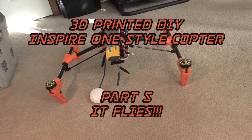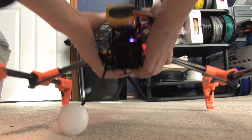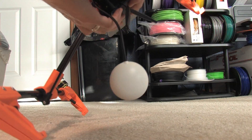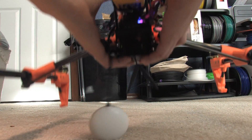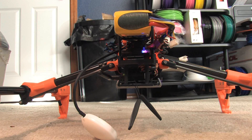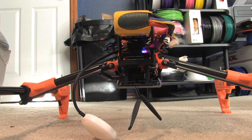Things are put back together and I think I know why I crashed. Taking off from an unlevel area results in two motors spinning way faster than the other two, and the thing flying sideways probably until it has time to stabilize. Unfortunately I panicked before it hit that point so it never got the chance to straighten out. I think if I had more space it would have turned out just fine, so lesson learned.